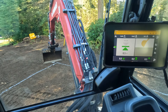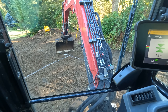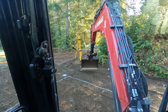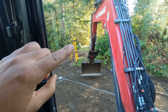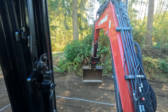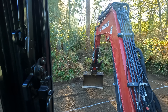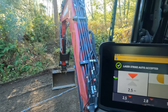Because when we track the machine, it doesn't know if we go up some kind of an incline. The way the machine knows what elevation it's at is based on the rotating laser up there on the tripod. So the next thing we need to do is sync the machine to that laser. On the side of the boom there's a little red reflector looking thing — that is what will pick up the signal from the laser and tell the machine what elevation it's sitting at.